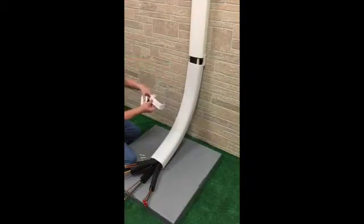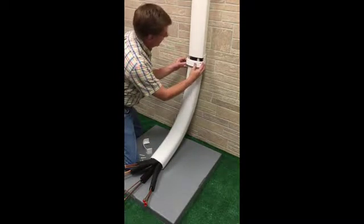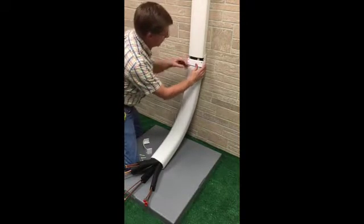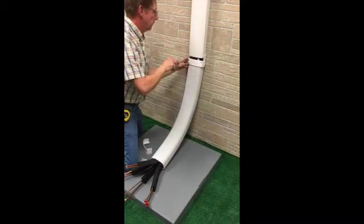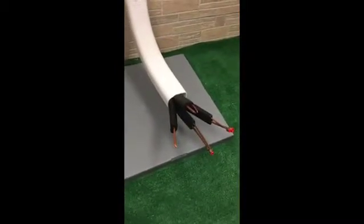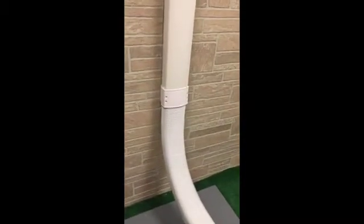The flexible adapter has 2 sides. The lower half has ridges. Those are what grabs the flex tube. Simply put it on the lower half of the flex adapter and force it down. Then put your set screws in and fasten down. Your job site now meets the energy code for pipe insulation protection and looks beautiful.